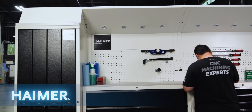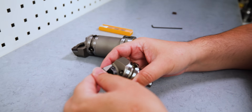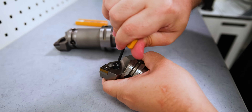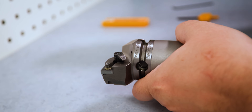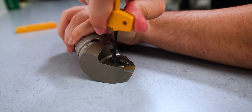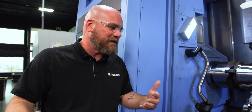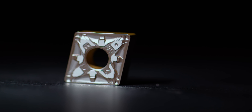This is the first launch in our new coating generation — our Ken Gold — heavily aimed at steel machining, going out there to attack the steel turning market. Really with the new coating, one of the big things we tried to do is help fight against heat, because that's a killer for any insert. When the heat starts to get through, that coating starts to get down into the substrate, and that's really when catastrophic damage starts to happen — you start to lose your edge. We're seeing huge improvements in wear resistance: 150 to 160% over what we used to do, and huge improvements in thermal properties, being able to protect against heat and keep it from cratering out on top.